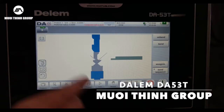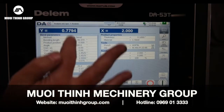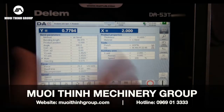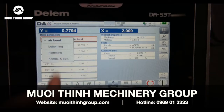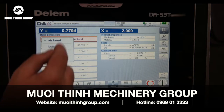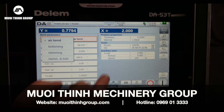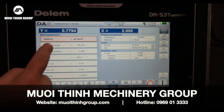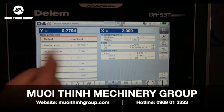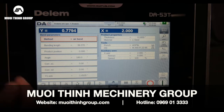I'm going to start off and show you the manual screen. In my manual screen I've got all functions of the machine — the press brake. The type of forming I'm doing depends on the dies and how I'm configured: hemming dies, bottoming, or air bending depending on the type of tooling. Bending length would be the width of the part. The machine needs to know bending length because it's going to calculate the tonnage and limit the tonnage to what you're doing.